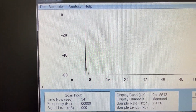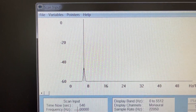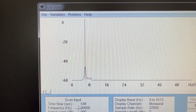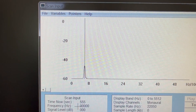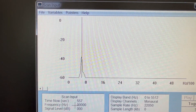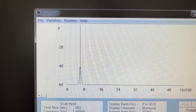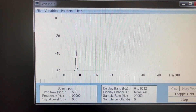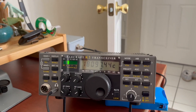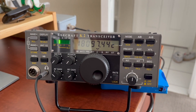There's a 400 hertz filter and there's a 200 hertz filter. That's the low-pass filter, and there's a CW filter — so 700 hertz, 400 hertz, 200 hertz. And you can see how clean it is. There's no other noise, just the signal. I have the DSP turned off right now on this radio, so it's just the crystal filters.